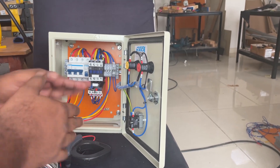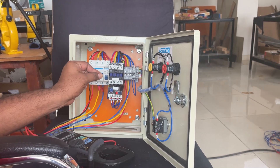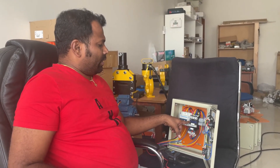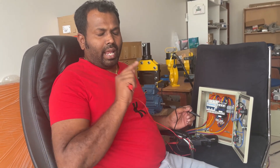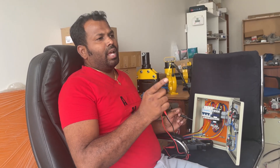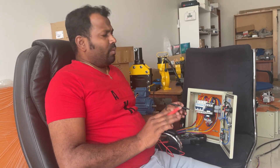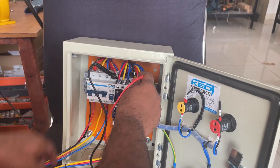What problem could cause this? Once the MCB is on and the switch is operated, the contactor is supposed to energize. Once this switch is put on, the contactor should energize — we need 230 volt control supply on the coil terminals. Each contactor has control supply terminals A1 and A2. A2 is the neutral side and A1 is the phase side. Once the switch is operated, A1 gets the control supply and A1-A2 together gives 230 volts to energize the contactor. We check A1-A2 voltage and find there is no voltage on A1 and A2.